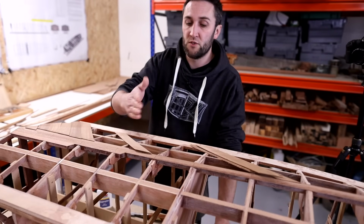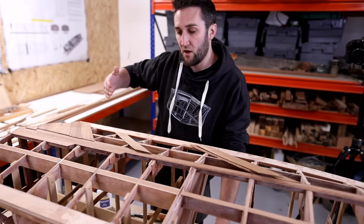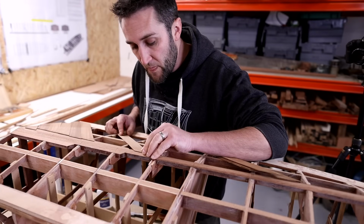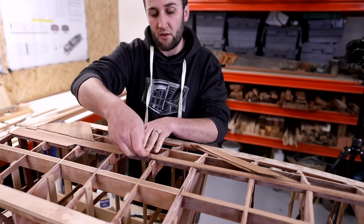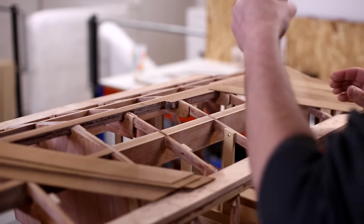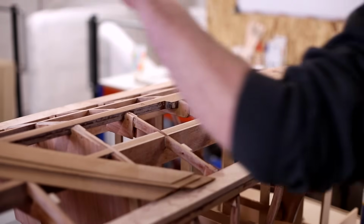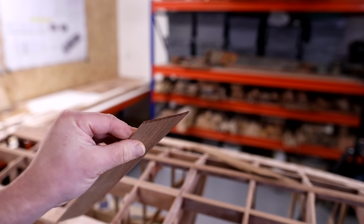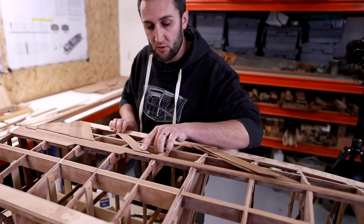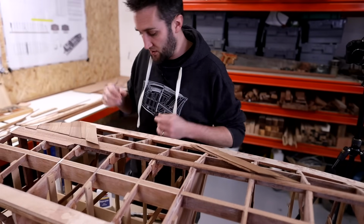And we want our first planking layer to be running aft in this direction. So I've got this first plank here cut, so we're lining up nicely with the center line on the keel there. We've got a good fall, and then I've got a slight bevel on that plank, which you can probably just see there, just where that lands down onto the chine flap. So I'm just going to use some quick set and glue and get that one stuck in place.